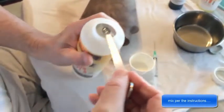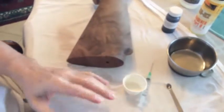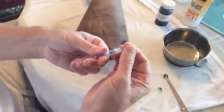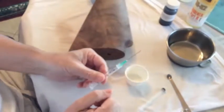To begin, we'll start off with two-part epoxy. Unlike glass bedding, epoxy does not have a long work time. The minute you mix this, you want everything in place to move along quickly — this isn't a rush, but once you put the hardener in, you want to move along pretty quickly. Just as a word of advice on these syringes: double-check that the needle is screwed in. I'll leave to your imagination how I was reminded I hadn't done that.